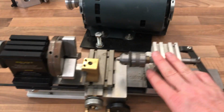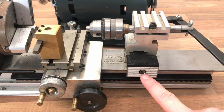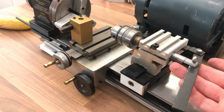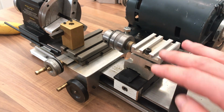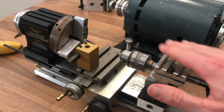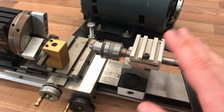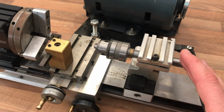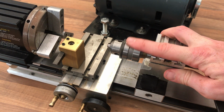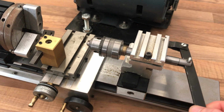Right, finally onto the tailstock. Another locking set screw here into an aluminium extrusion. The tailstock itself can be offset on this dovetail, which will provide a basic means of taper without the compound slide. Now, in my eBay listing, I didn't actually receive a centre of any kind, but that'll be easily enough picked up. It's got this Jacob's chuck, and look at this for a nice mechanism.